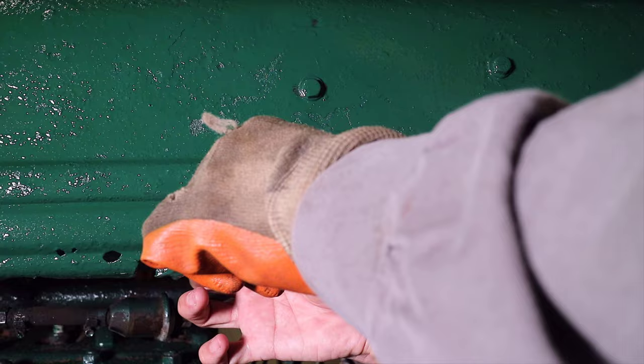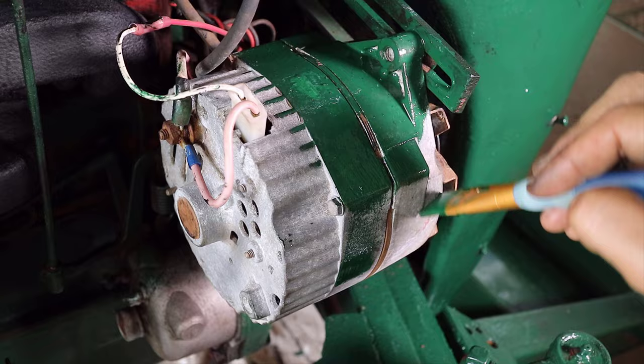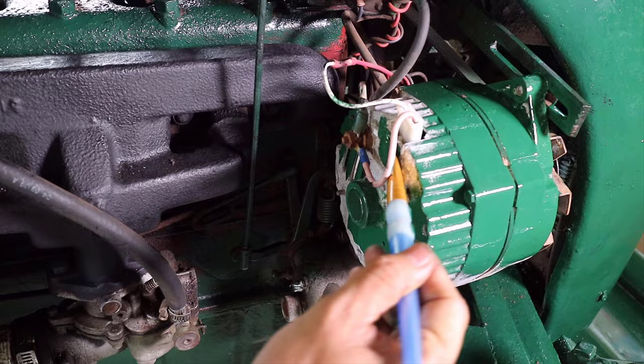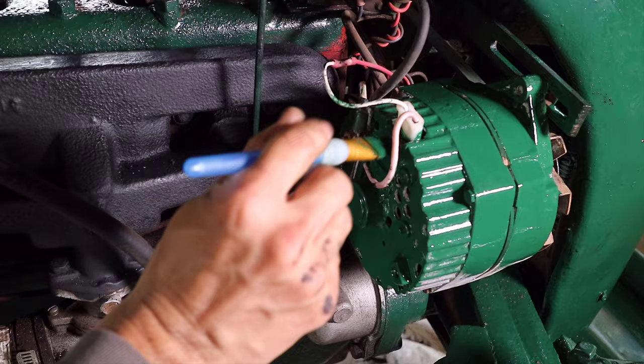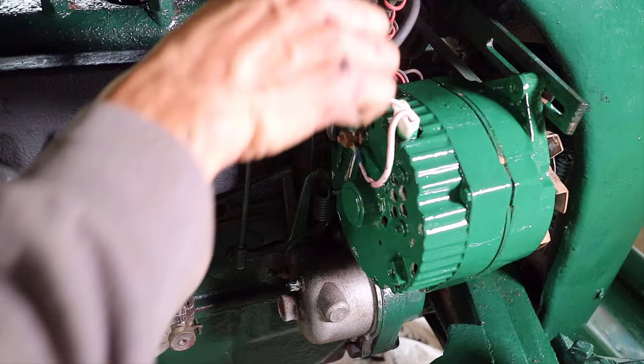I also painted the PVC piping used as the air intake tube, which will likely be replaced but I wanted to match the colors. I then painted some of the hardware that would hold the fuel tank support against the hood. Since the corrosion on the alternator would likely return I just decided to paint over it, along with some of the parts near and around it. This gave me a good idea of the color I want to go forward with. The painting also gave me a chance to spend time looking at the parts and start making choices about tasks to accomplish first. I let it dry for a couple days after the photos, though brush paint this thick typically takes a week to fully dry. I am satisfied with the results as it will help delay the rust while I try to get this tractor working in the yard.